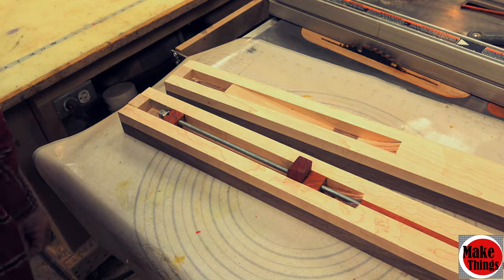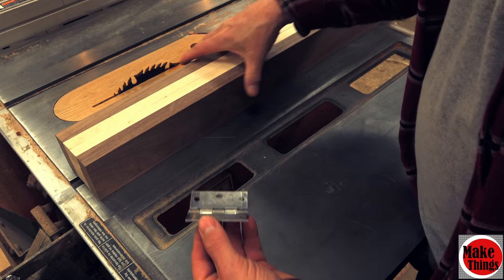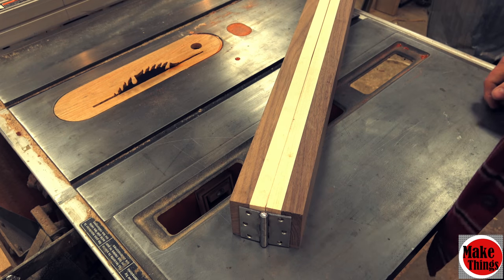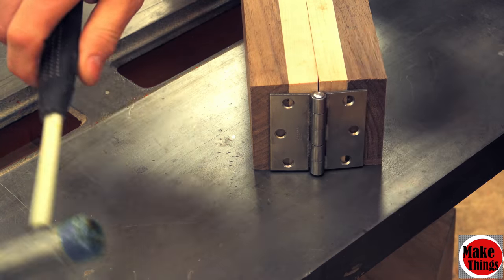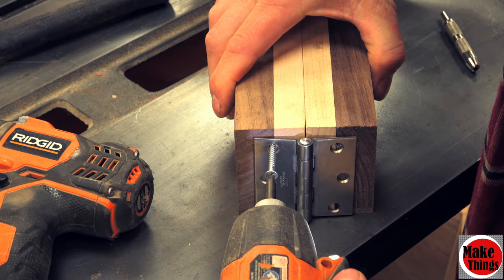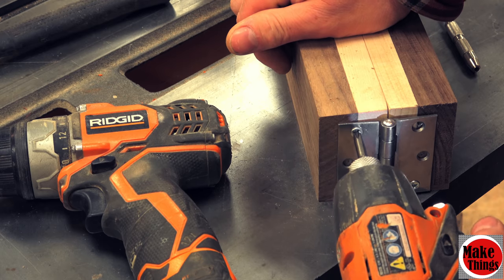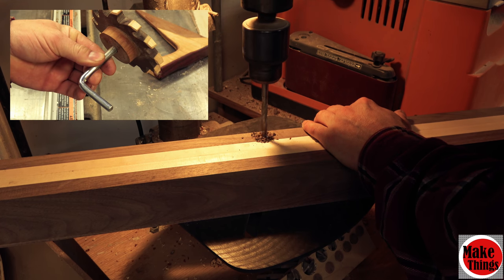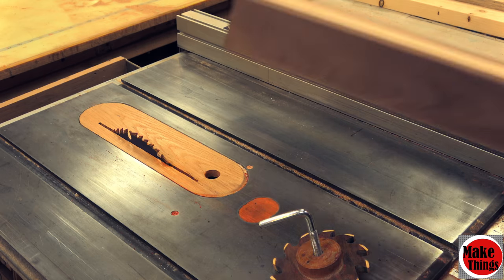Both halves are ready to be joined now. With a little carpet tape I attached the hinges, making sure it was as dead center as I could make it. A clamp in the middle of the jig helped to keep movement to a minimum. The hinge I'm using here is both two and a half inches wide and long. Be sure to buy some extra long screws and don't use the ones that came with your hinge, as we are dealing with end grain. Now we'll drill a hole for our fence clamp. If you feel safer using more than one clamp, drill out more holes, but I found one clamp was enough to keep it secure to my fence.